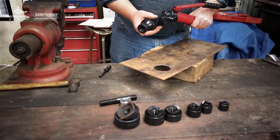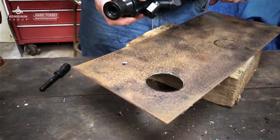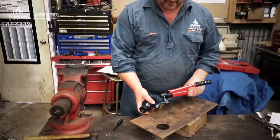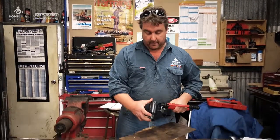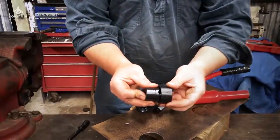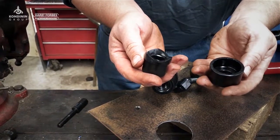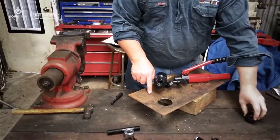It's a pretty interesting looking piece of gear, but basically it enables you to press large diameter holes. This particular item will do up to 3.5mm in mild or stainless steel. Essentially it's a hand-operated jack and a ram set up to pull, bringing a cutting edge and a die together on the side of the steel and just pressing out what is really a large washer.